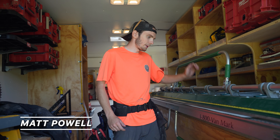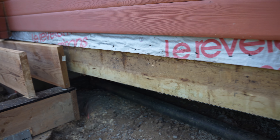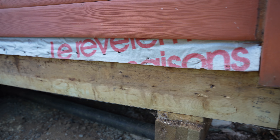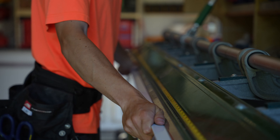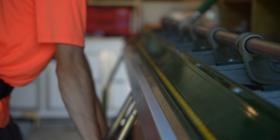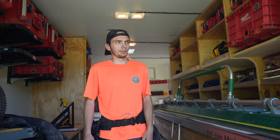In here I'm just bending up some metal on the brake. We are flashing the old rim joist on the house because we are not attaching this deck to the house. So I'm just putting a metal flashing on there to basically give it that nice protected seal.